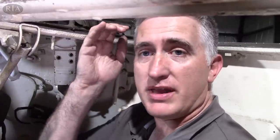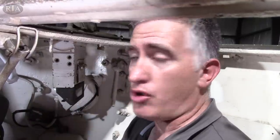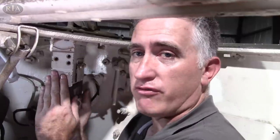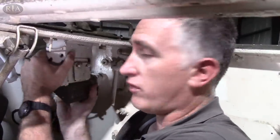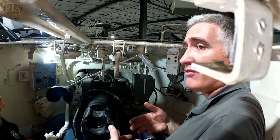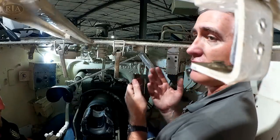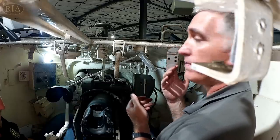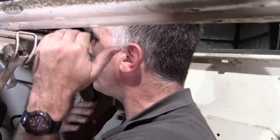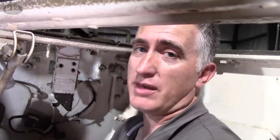Just above me, where I go down a little bit more in this seat that raises and lowers — it does lower a bit, but frankly my legs don't have any more room. There is that rotating periscope I'd mentioned before, and there is another one directly to his front which also elevates as well as traversing. So the TC has reasonable observation. He can actually lift the chair even higher, sit down comfortably with the hatch open and his head out, and he will be at what we call eyeball defilade — which is exactly what I'm at right now — where you can see that the only thing exposed is from here up, much less chance of getting hit by something hot and nasty.